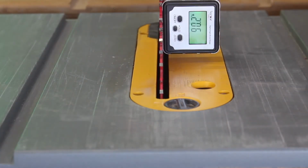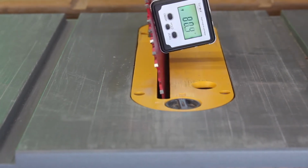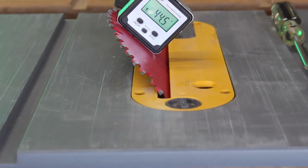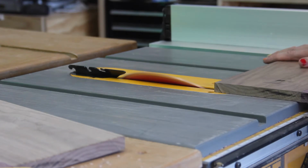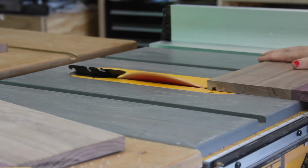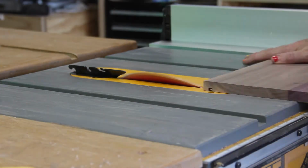Now we're going to cut the miters for the box, and I'm actually going to set this to slightly more than 45 degrees. That way when it's all put together, if there is a gap, the gap will be on the inside corner and not the outside. Hopefully that makes sense. If not, the Four Eyes channel has a good explanation of that, and I'll try to remember to put a link of that in the description. If I don't, just leave a comment reminding me and I'll get that added.